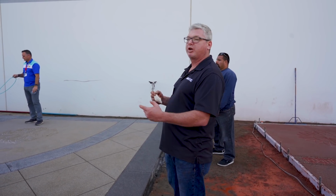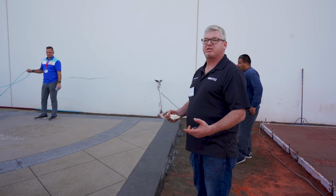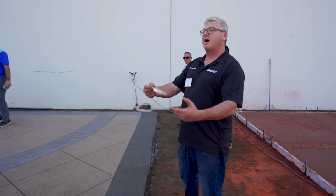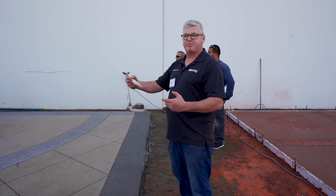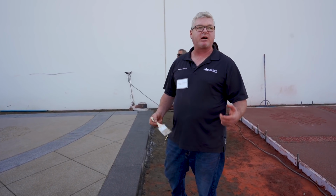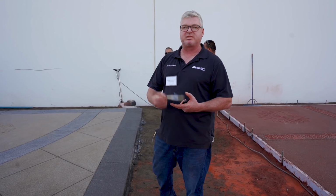That's why drips are not good, because that's more sealer. And if you're trying to keep a two coat system going, you wanna be consistent. So you want a guy cutting in and you want a guy that's following right with you with your sprayer. You wanna keep everything consistent. That's one thing about concrete, everything is about consistency. The guys that do the good work are the guys that have the eye for detail for consistency.